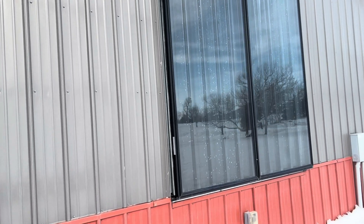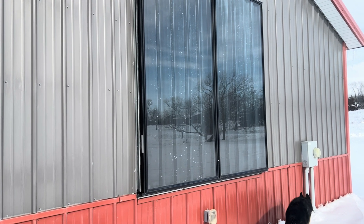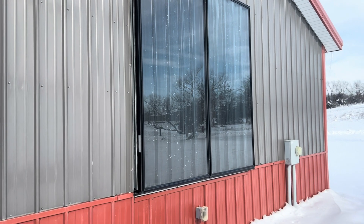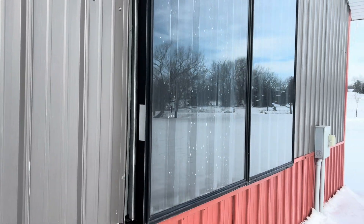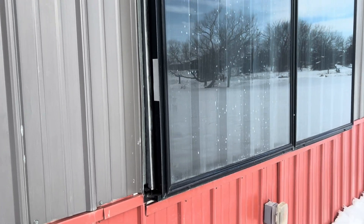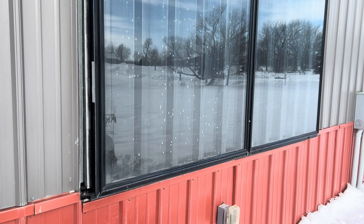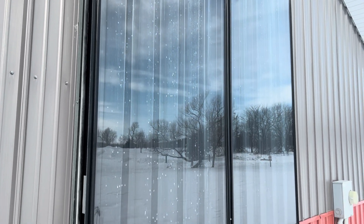The process is then repeated. This solar panel was made by a company called Solar Sheet — don't bother looking it up because I don't think they're in business anymore. It was not an inexpensive unit; it was about three thousand dollars for this double-sided unit. They rated it as appropriate for this size of garage, which is 30 by 40 feet — 1,200 square feet. It's never really made the garage warm, but the purpose is really just to keep it above freezing. It's made out of metal and slightly recessed into the building because that's how I designed it. It was actually quite hard to get — almost all the units shipped were damaged because they're pretty fragile.